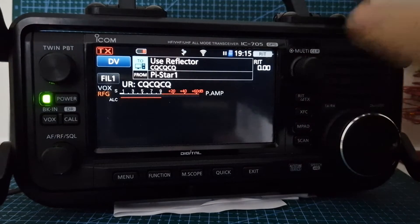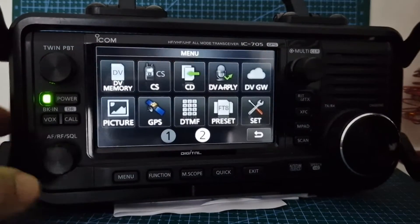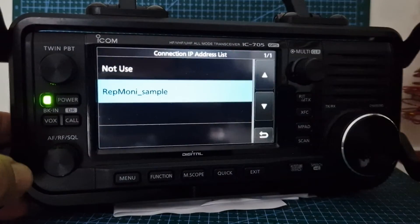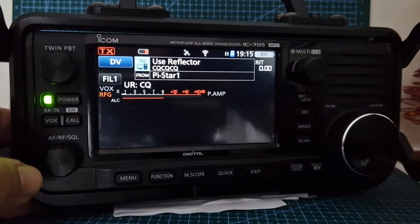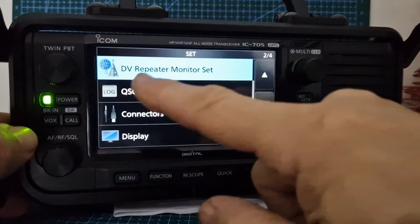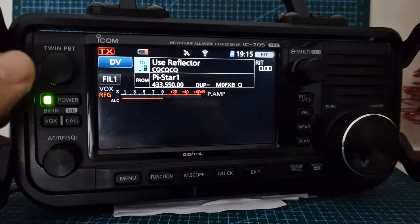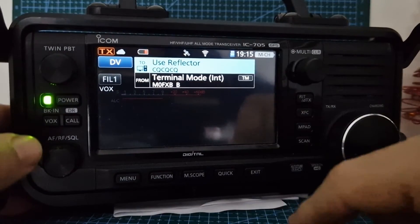Thanks for watching. The new feature is Repeater Monitor. Go Menu > Set > Repeater Monitor Set. Mine shows 'Repeater Monitor Sample' — that's actually a CSV file. Yours will say nothing new, so you need to get that file with the latest firmware from Icom. It's a repeater monitor file — put it into your SD card in the folder called 'Repeater Monitor.' Once you've got that, when you go Menu > Set, the new menu DV Repeater Monitor will appear with the option to select repeater monitor, which is a list of repeaters and their IP addresses.